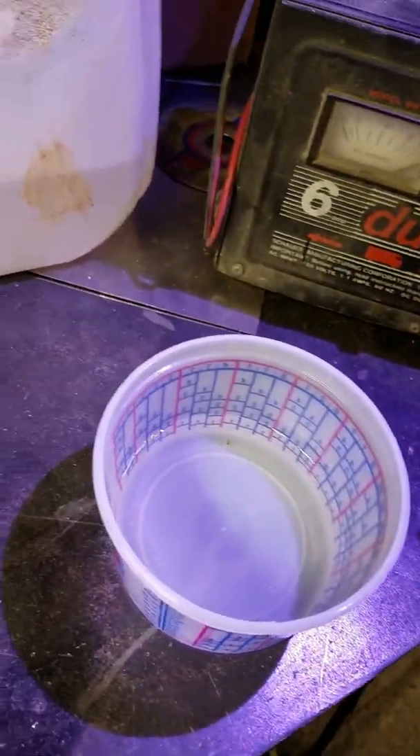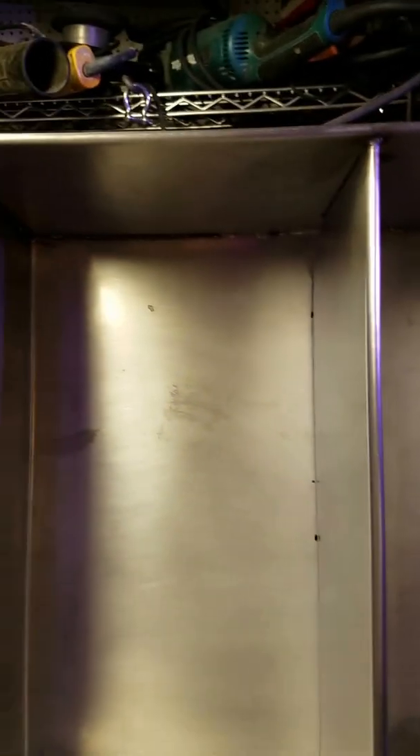Let me stop and explain what I'm doing. Back in the late 80s, early 90s, this old Dutch guy at Delta Sheet Metal in Van Nuys told me how to passivate metal. It's a weird old-school way of doing it, but it brings back the stainless properties of stainless steel, because when you weld it, it takes those properties away. When you passivate it with electricity and muriatic acid, it brings them back. It's an old tip from an old Dutch guy and I've been doing it ever since — it works really well and makes the welds all shiny again.